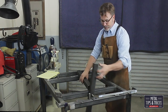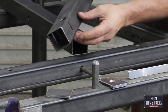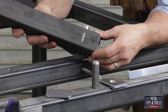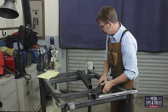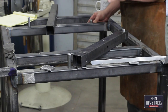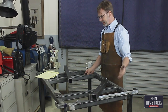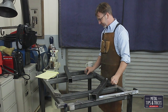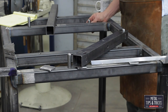I've already pre-drilled the holes for everything. I drilled the holes out at the end and milled in a groove in the side, and I'm going to TIG weld that in so the pin is held in securely. On the opposite side I've got another set of pins that are going to be welded on the outside of this beam. The reason I'm welding it on the outside of the square tubing is because when I originally built this stand I didn't know about Bessel points and how to calculate them and I just guessed. Fortunately I guessed pretty well — I thought it would be in the center, but I'm going to be able to put it right on the outside edge and be within the tolerance I'm working with.